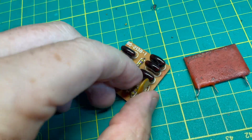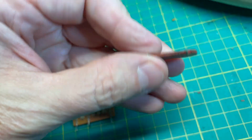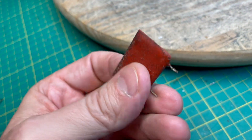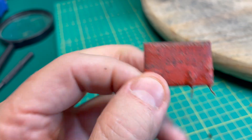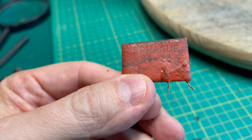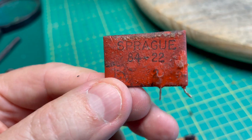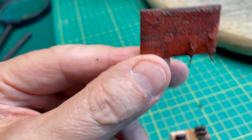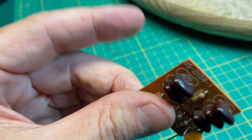This is what that board looks like. And here's the PEC. Basically, these PECs are kind of like ancestors of the integrated circuit. I've never opened one up and looked inside — I don't know what's in there, I'd love to know. What they do is enable the manufacturer to squeeze a large number of capacitors and resistors into a small space. These only have resistors and capacitors, unlike an IC which has diodes, transistors, and whatnot. And that's what's on the phase shift circuit board too.